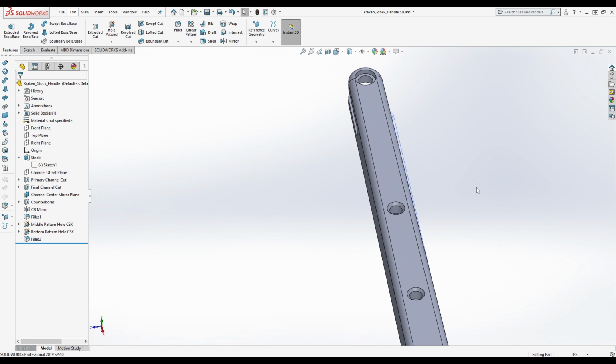It's kind of funny, Jay. Remember how I was complaining about how I was not happy about how that countersink was a different size? It actually makes sense now. How so? Just because I think he switched the size of that hole, but he had already drilled this handle, and he switched the finishing code, basically, as though all the remaining handles to be finished were ones that had 3/16 inch holes at the bottom, but this one didn't. It still had the 5/32 inch hole. So it got finished unevenly. And he was like, sure, ship it out kind of thing, which I don't think is unreasonable for the price point he's going for at all.